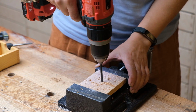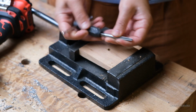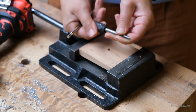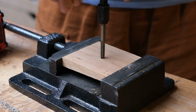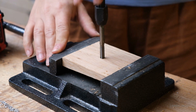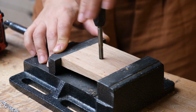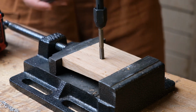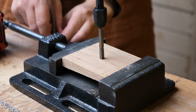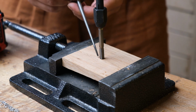So you find the right tap, put it in this guy right here, pressure fit. I'm gonna do this, put this here, and we start spinning. And it's the same principle as when you did the opposite, or the inverse. Now, one thing that's always a nice idea when you are making screws, whether wooden screws or metal screws, is to use a little bit of mineral oil to lubricate.